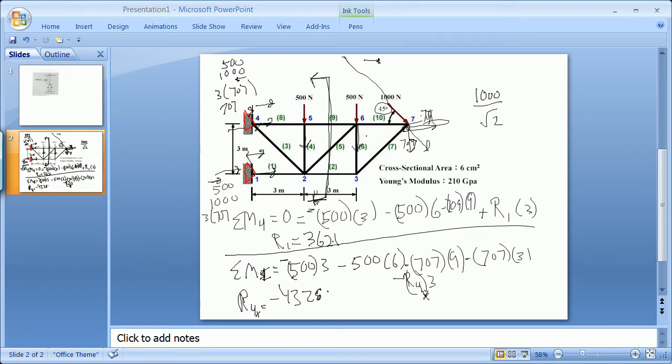We'll be looking at the right side, but I will tell you, learning to practice doing reactions in this way is good training. Do them both by sum of the moments about both the supports, and then also do them by the logic of the spin, especially when you get forces that are straight up and down or left and right. Thanks for listening.